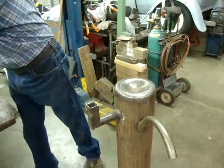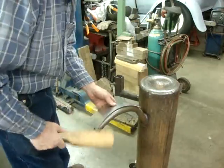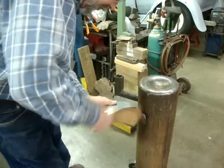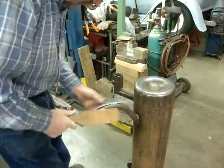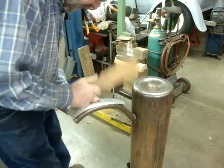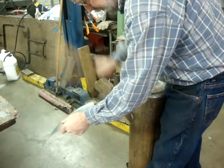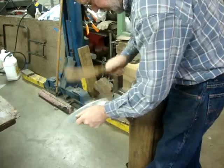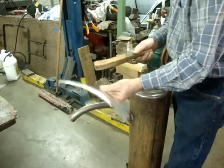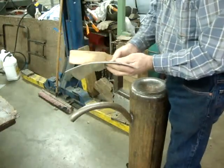And then this piece here, normally I would do this way. So now if you're looking to do a compound shape, this gives you the perfect edge to do that over. So there's another shape you can do, a compound curve in both directions. That'd be the nice edge of a fender, or if you're doing wheel tubs on a car. Anything like that.